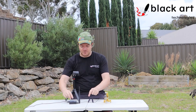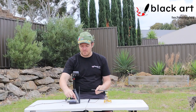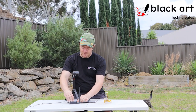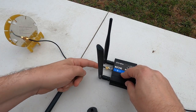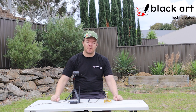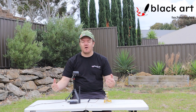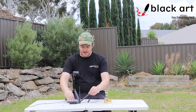So the reach is going to be much less because you are halving the power. What you should do alternatively is use one port connected to the external antenna, and on the second port just leave whatever you have on there — the internal antenna. That way your second port won't get as good a signal as the first, but it still gets something significantly different, and your MIMO modem will prefer that over receiving the same signal twice at half power.